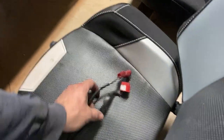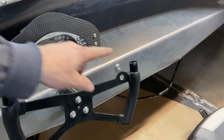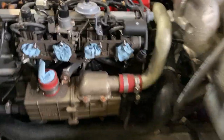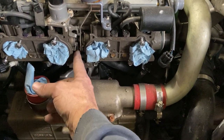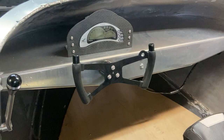All the other things I still have to do are a little warning horn and the steering position sensor getting plugged in over there, and then it's off to the races. So today my goal is to get the steering thumb or finger throttle built in. The Honda actually has the throttle body back on the engine, so I have to build a throttle cable that runs all the way up. I'm going to route that from here up to the midship, then up the gunnel and over to the throttle.